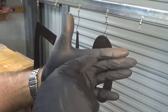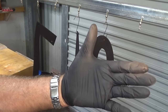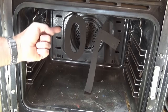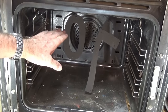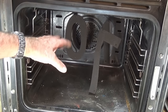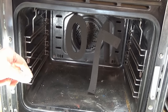I think this Empire Copper Vein powder coat actually has real copper in it - it shows up on the gloves as a shiny metallic finish and the powder itself is quite heavy, which may be a good thing for outdoor use. I've loaded the parts into the oven while cold - it's much safer that way, as there's a wire frame inside you have to hook the hanging wires over, and with hot elements above and at the back you could burn your hand fumbling around in a hot oven. I'll close the door and let them cook.